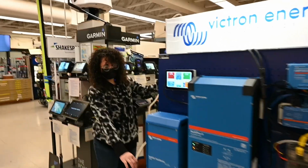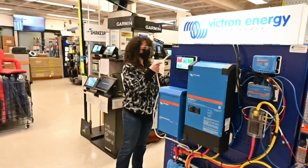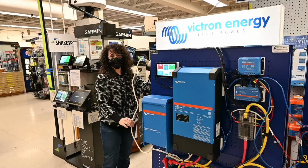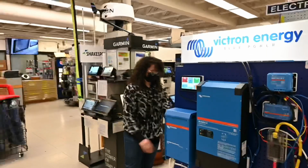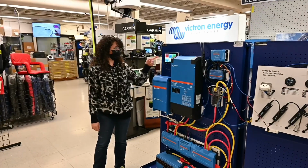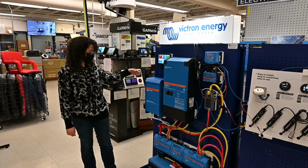This used to be an extension cord that we cut the end off of because we needed something with a plug end, but we didn't know how to install an end on some wiring, so we just used it. It's an extension cord with 14 gauge wire, and it's much smaller than what they recommended for this charger. So what we did was we limited the input current to 10 amps to make sure it wouldn't get hot. And that's all we really need for this.